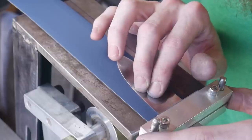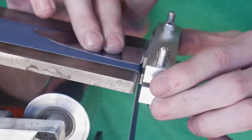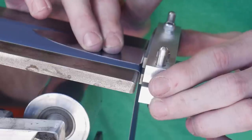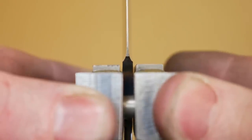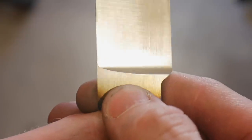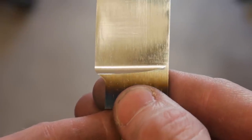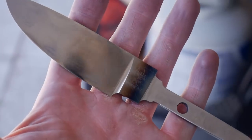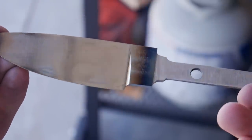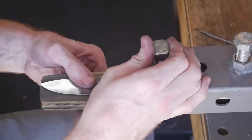Slow belt speed and very low pressure for this operation. This actually took a really long time, but I think the results were fairly good — it's going to take a little practice. I have a little bit of meat in one spot, so I grind back the ricasso a little bit longer to get the edge at the beginning of the plunges a little thinner. Like I said, it came out pretty good — very symmetrical plunges — and I will mess around with that contraption again in the future for sure.